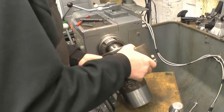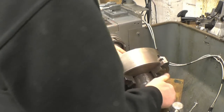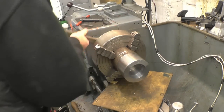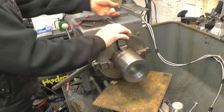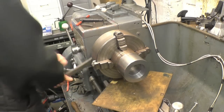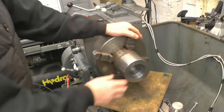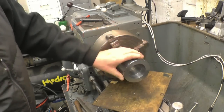It's quite a heavy lump when it's got that big bit of bar in it. So that should be running nice and true still, which it appears to be. Now we need to cut the 6 TPI thread in here, but first this needs machining down to size.